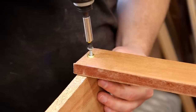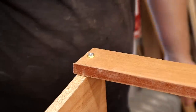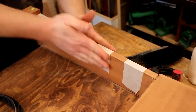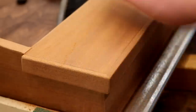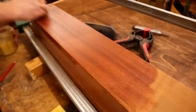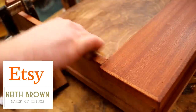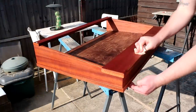I used screws with washers to secure the top panel, and then I could add trim to the edges of the side panels too. I did some final hand sanding and then I added some of my homemade oil wax finish to bring out the grain and colour of the wood. This stuff is available to buy via my Etsy store and there'll be a link in the description box below. After applying the wax I immediately wipe away any excess with another cloth.